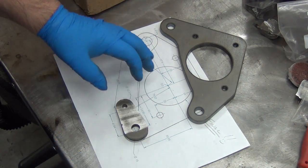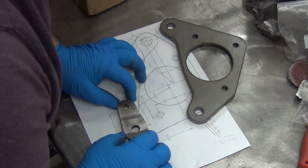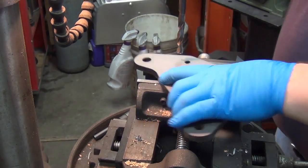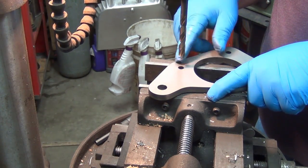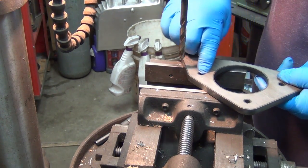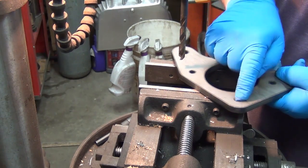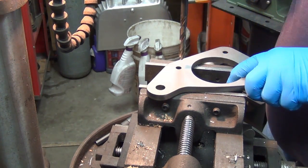Right on the money. I'll pull out a couple of drill bits and see how easy it's going to be to drill through there. I've got three-eighths set up, RPM set pretty low. I want to start from the top side because that's going to be the most accurate - any wander or blowout I don't have to worry about. The darker ring on the other side means a larger heat-affected zone which makes it harder on the drill bit, so starting from this side with very little heat-affected area, the bit should bite and run right through.